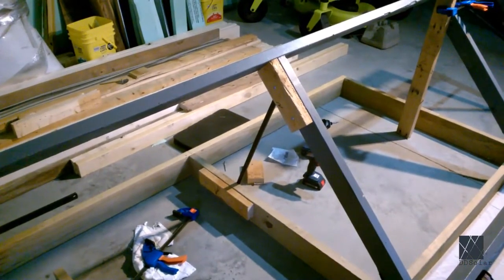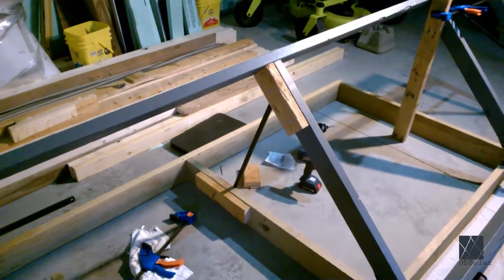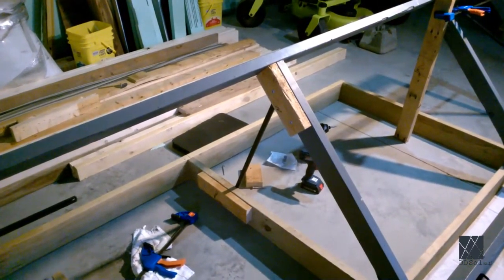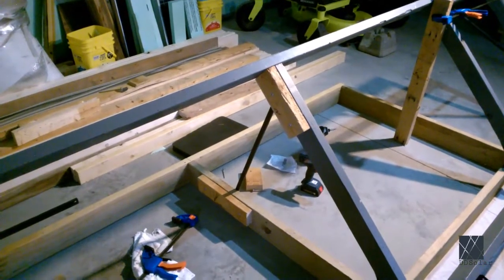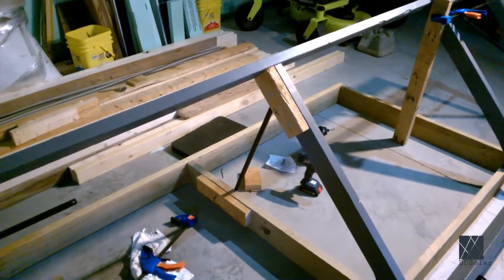I use two 3-inch structural screws per block to attach it, not counting the structural screw that attaches the tilt angle adjustment bar. At this point the frame is pretty much complete. I'd only need to install the two props at either end, and that isn't very difficult. And frankly, I'll probably do that after the solar panel frame has already been put out in my yard.